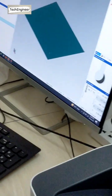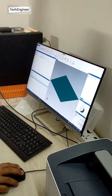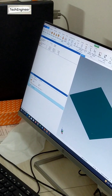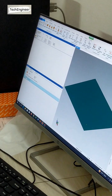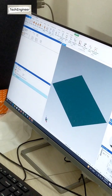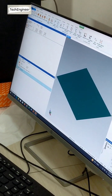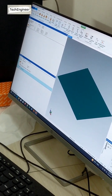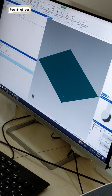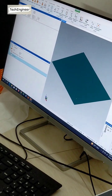What is the graphic? That graphic is coming here. So the graphic comes here with the plane name, and you can see the plane here also. And that D is denoted by the flatness. What does D denote? D denotes the flatness deviation. 127 is the length, how much length we are covering for measurement. And 100 is the area which we cover. This one is flatness. L is the area covered. D is the deviation, and there is a number of points. So D means deviation. Deviation is a kind of flatness.